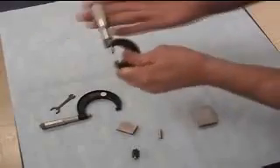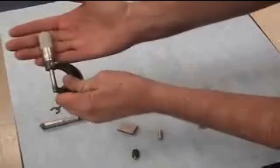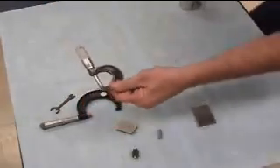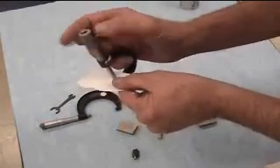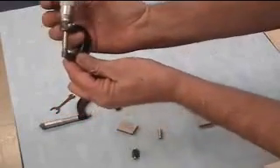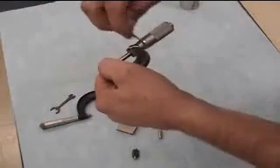I want to check it in two different locations, so I'm going to spin it all the way closed. You can see it's actually reading two-thousandths when it's closed. I'll take a piece of paper, put it in here, close it, snug it up, and pull it off — that gets away any grit or grease. It still looks like I'm about two-thousandths of an inch when it's closed. If you went to make a part and measure it with this, that would be what we call a bad thing.